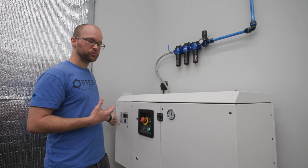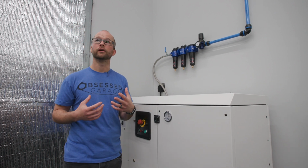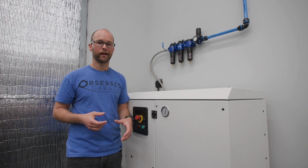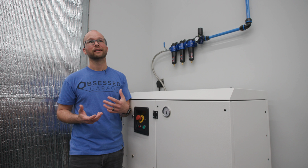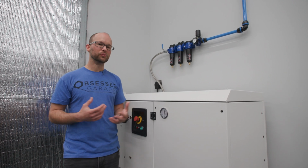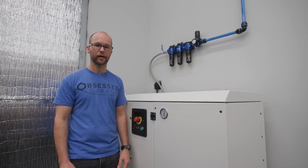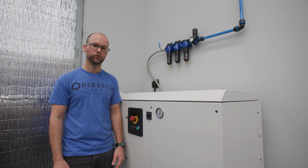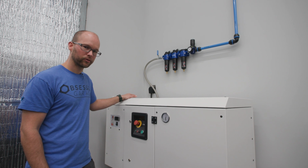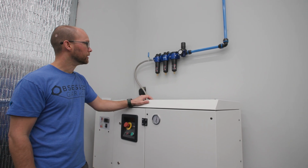We honestly don't always use the dryer here at OG. We have very humidity controlled air and air conditioned and all of that. So if you have a space that's humidity controlled, air conditioned or heated, and you're not really doing anything too intense, like we're pretty much filling tires and blowing out polishing pads, occasional pneumatic polisher use, you probably can get away without a dryer, especially if you live in a really dry climate.